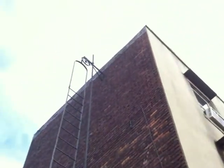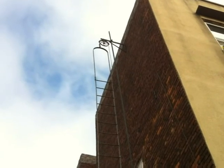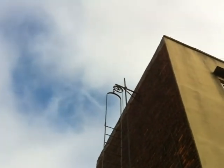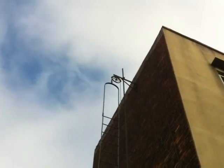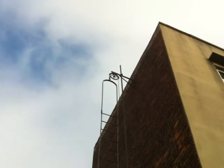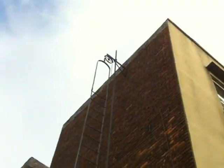That pulley system up there, it's original to the building. Those pulleys are cast iron. They're not reliable anymore. So you need to basically just get a new pulley system that the cable will go through. They're much smaller. They're also housed, and some of them will have a simple bearing system on them, but that cannot be utilized currently the way it is, because if that wheel pulley ever breaks due to the casting, this will all come tumbling down to the ground. So the cable and the pulley up there need to be swapped out.